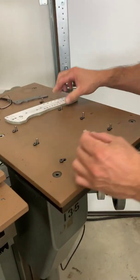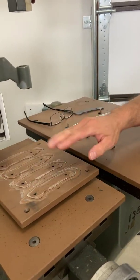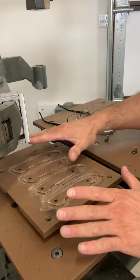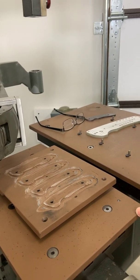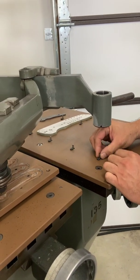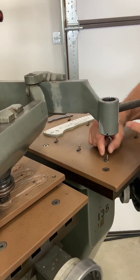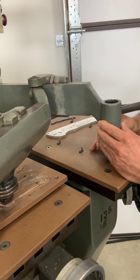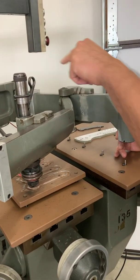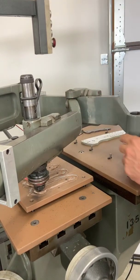So how do I locate these tooling holes on this plate? Imagine this plate all new, no holes drilled, and it's mounted onto this master plate. What I'll do is I'll take a stylus, bring up the table, and put the stylus into the bushing hole, which will actually lock these arms in place and it will not move. Then I'll take this lever and I'll drill a hole all the way through — I won't spot it, I'll drill all the way through.